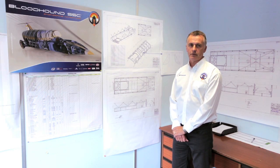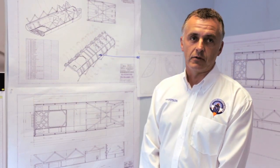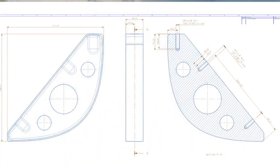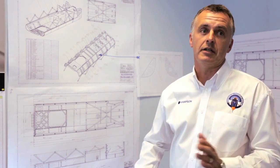First I met programme manager Ian Gaskin. He explained how the part made today would be used in the car. The silver bulkhead that we're machining today fits in between the inner and outer structure of the lower frame assembly. Both outer and inner skin will be riveted to the bulkhead. It minimises what we call the panting effect down the length of the skin — basically stops it fluctuating in and out.